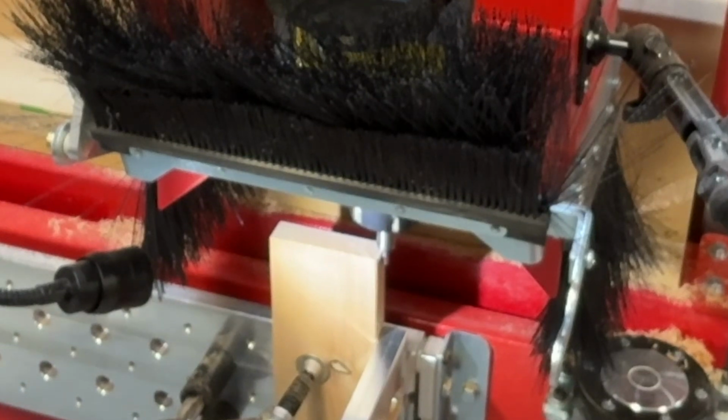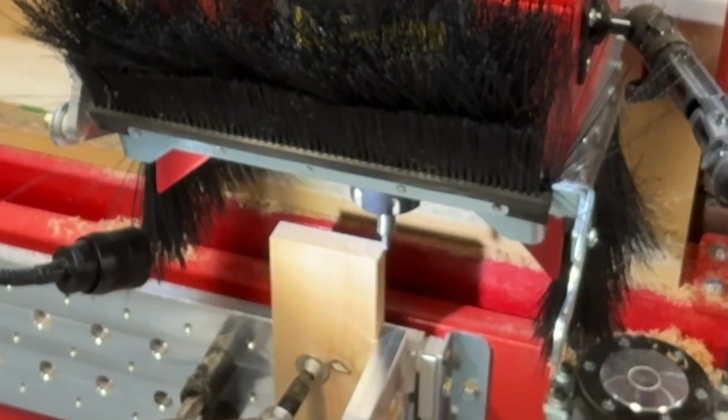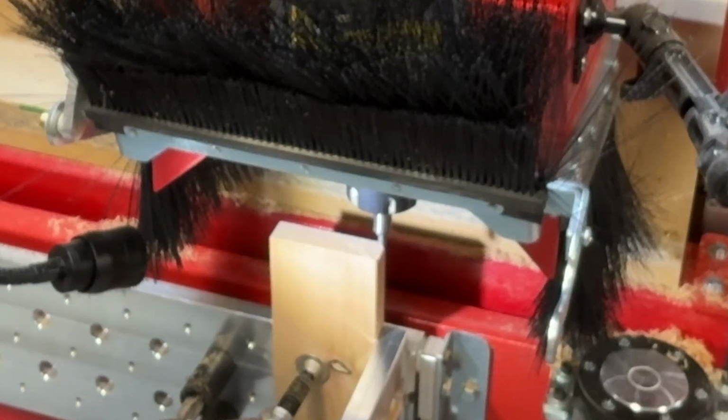We'll stop the spindle, get rid of that extra noise. We're going to go back to step jog in the positive 0.1, so the plus button. I'm going to jog up first so we don't bump into anything. Get it above the material. Then I'm going to move towards the material 0.1 inches, which is what my step jog is set to. So that will put the center of the spindle or the tool exactly at the edge.